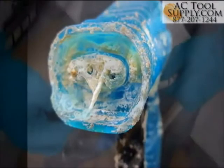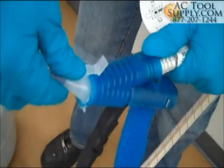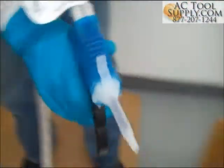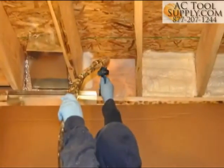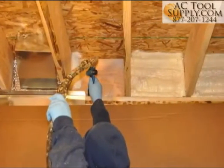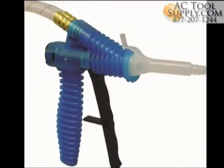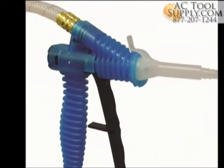Attach the nozzle and when spraying the dispensing unit for the first time and with each new kit, dispense foam by squeezing the trigger only halfway and vary until the desired output is achieved. This controllable metering is a major advantage of the handygun, allowing complete control of the flow rate to suit the application.